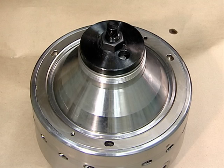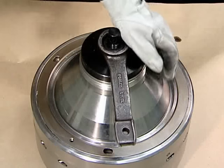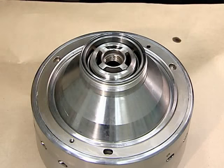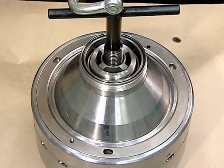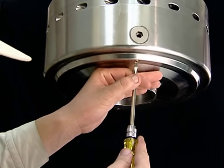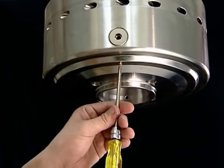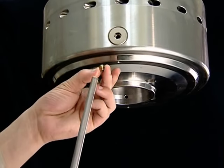This completes the assembly of the bowl. We will now explain the procedure for mounting the bowl on the self-jector. Before mounting the bowl, remove the disc clamp plate. Set the bowl lifting jack on top of the bowl head and lift. With the bowl lifted up, inspect the two drain nozzles mounted on the bottom of the bowl. The slits on the drain nozzles are 0.9 mm wide on small and medium-sized models and 1.1 mm wide on large models. Remove the drain nozzles and check for clogging.